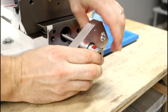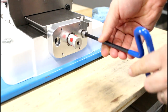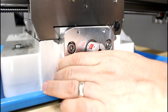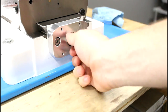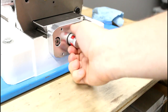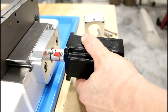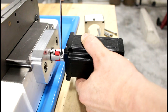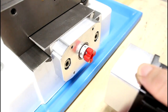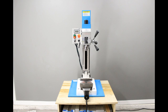Push the other half of the coupler back on. Now we'll slide the saddle back until the flange butts against the base of the milling machine. Loosely thread in the two socket head screws. Translate the saddle forward by spinning the coupler. We'll level the flange and lock it in place with the two socket head screws — we should be able to easily translate the saddle back and forth by hand without any binding. Make additional adjustments as needed. Next we'll install the stepper motor: insert the axle of the stepper motor into the coupler, use firm pressure to seat the axle all the way forward, and clamp it in place. Separate the coupler by pulling the stepper motor back. Align the spacer with the face of the stepper motor, rejoin the coupler, and securely mount the stepper motor using the four socket head screws.